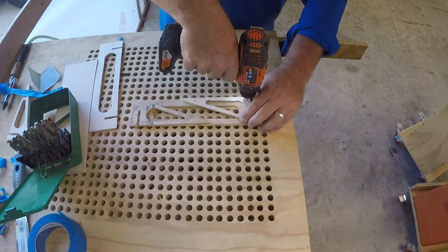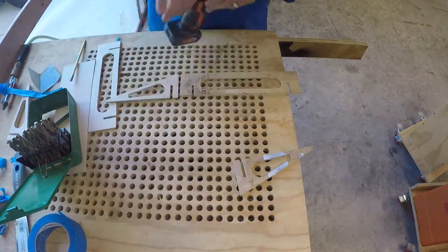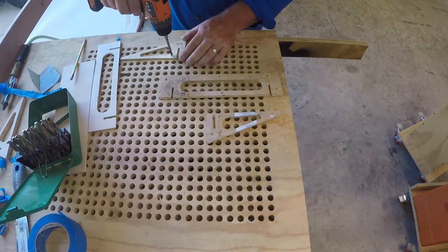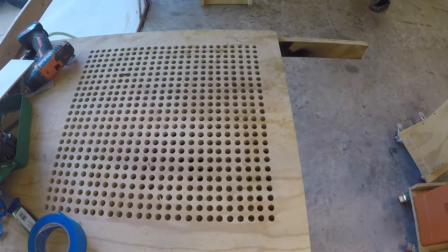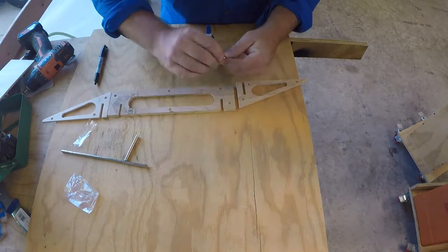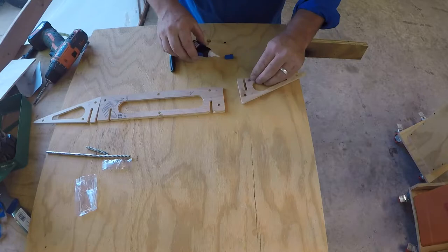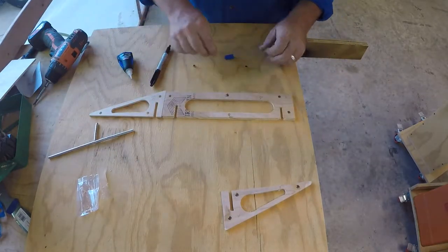I want to make this thing magnetized so it sticks together and there's not a bunch of loose pieces flopping around in my computer bag. I got some refrigerator magnets — little tiny quarter-inch magnets — so I'm going to take a Forstner bit, hog those out, and glue them in with super glue. Super glue will hold just as well as epoxy if you let it dry properly. I'll take the negative side and the positive side of the magnet and mark it with a Sharpie so I know which end to go down — otherwise the magnetic force will push it up. It just clicks together super strong.